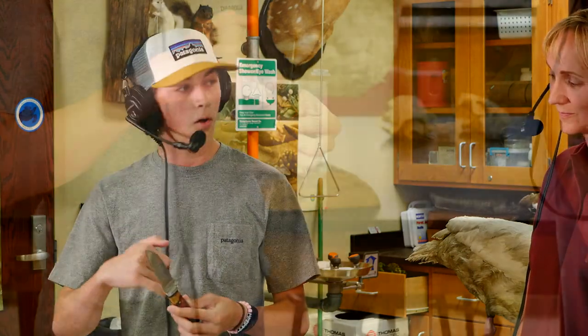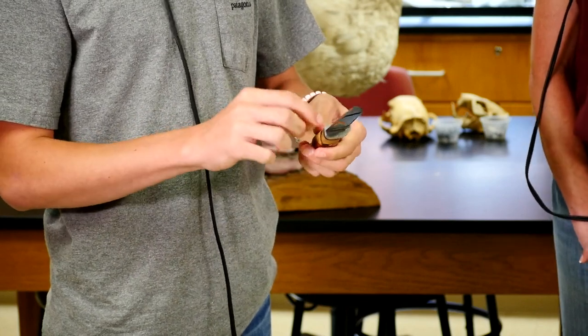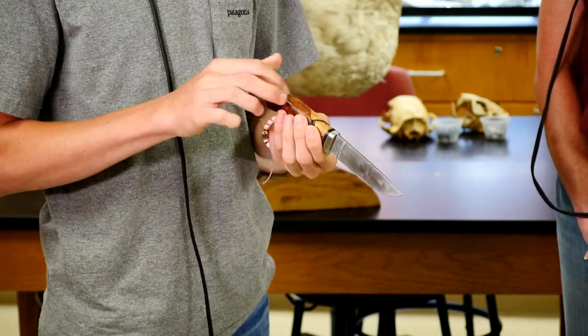And then from there, after it's dried, you'll grind it to the edge of the knife. With this one, you go to the edge of the knife because this is called a full tang, which means that the metal runs all the way around the knife. This one would be considered a hidden tang. Once it goes inside the handle here, it really narrows out, so that just has a hole in the handle that this fits into. There's still a pin in it, but it's only one, and it's wood on all sides.